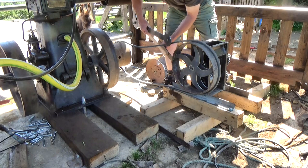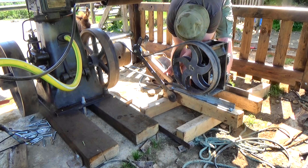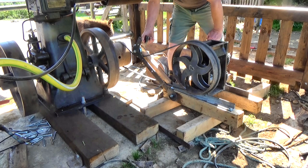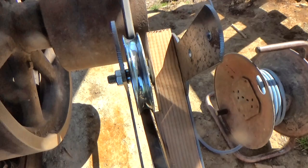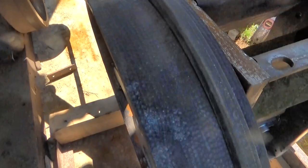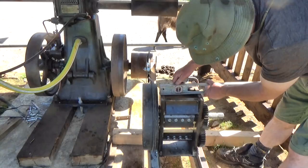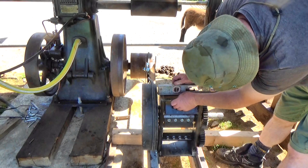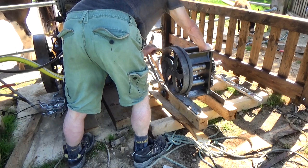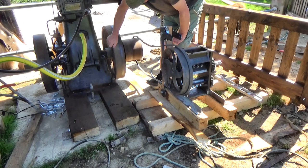Lining up the engine flywheel and the big chipper pulley was easy enough, although the belt didn't run straight until the chipper was level too, which makes sense. The chipper will need an input chute to guide the branches in, and an output chute for the chips, and some safety features would be a good idea too. But first I just need to know whether this whole contraption will work at all. The V-belt and the tensioner wheel and the clutch lever all have to work together to get the chipper blade spinning at 500 revolutions per minute.